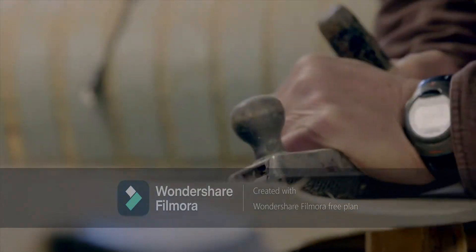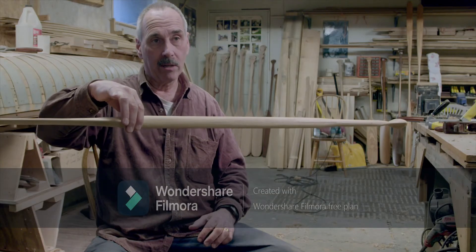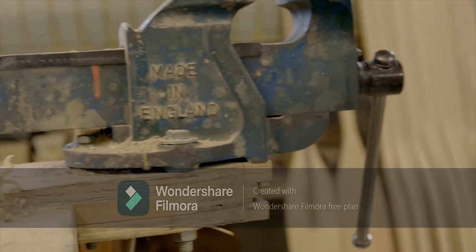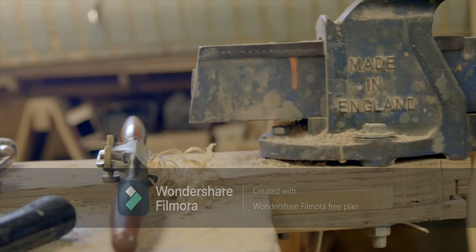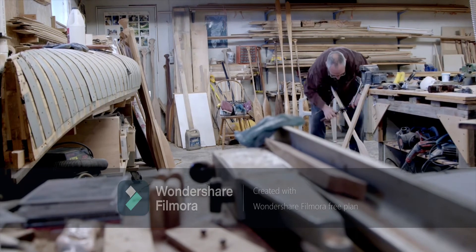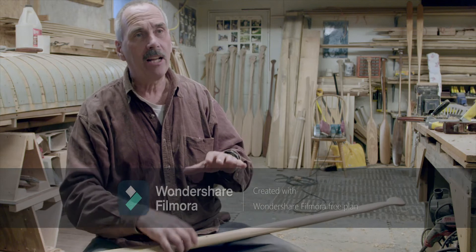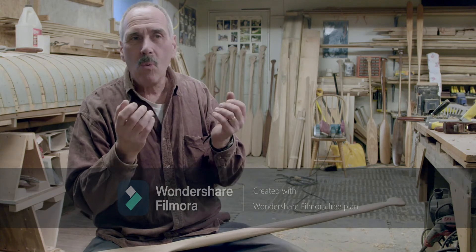After the rough carving, it comes the time of trying to make the paddle balanced, so that when you hold it here it's balanced properly. It may mean taking a little more material off the wings of the blade and off the tip area to remove some wood. We call that the fine carving stage — that's like getting your paddle the way you want it, that instrument.